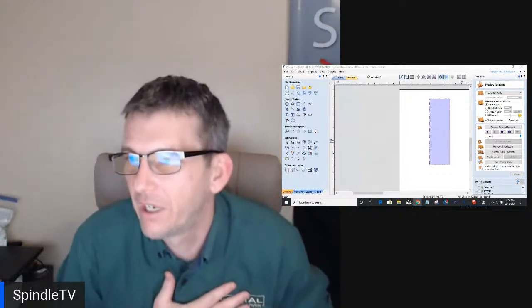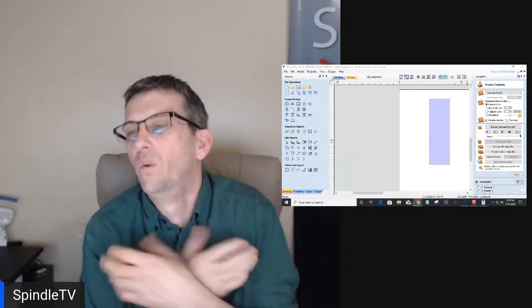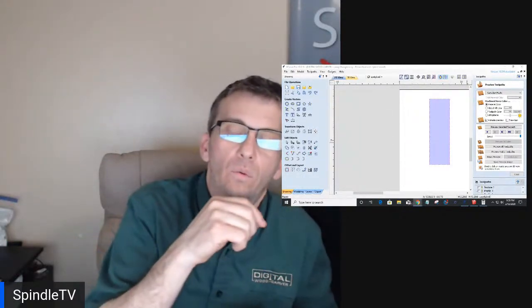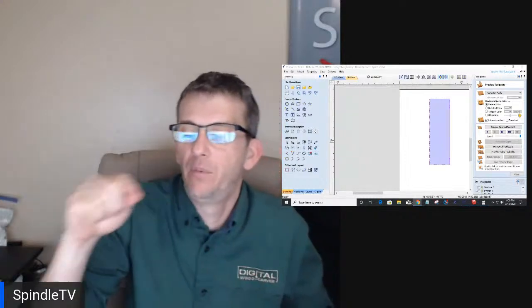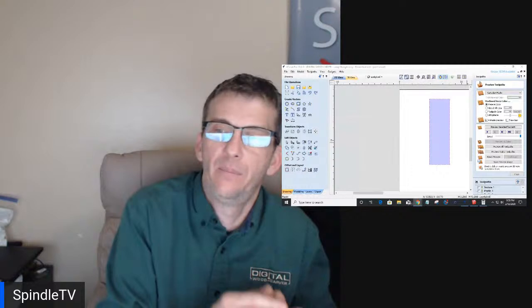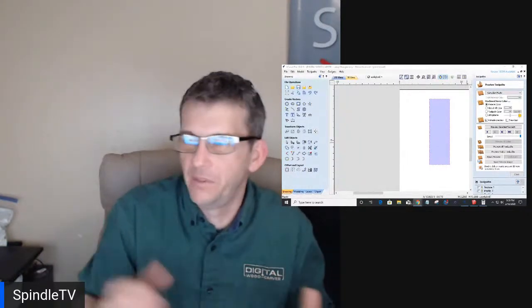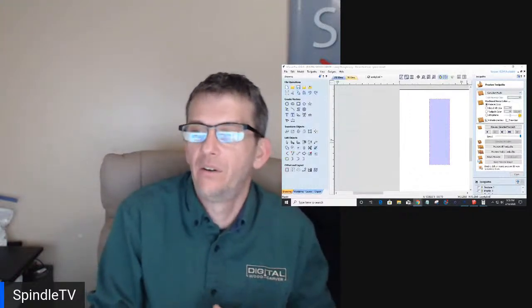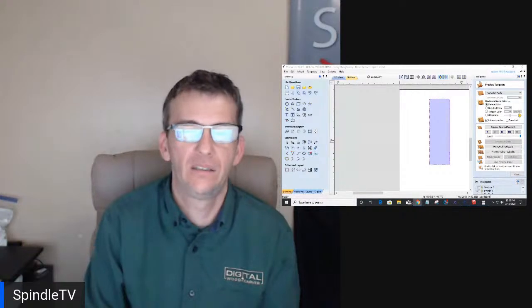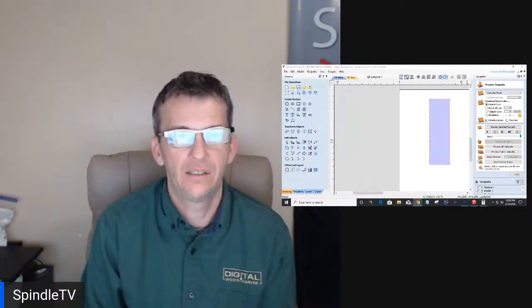But your material, you're cutting it out of plywood and your plywood is only 0.11, right? You can take your 0.11 material, divide that by the 0.125 and you'll get a percentage. And you can go into that size box and size that up by that percentage and it'll scale it up or down to fit your material. That way your slots are the right size. So a nice little way to utilize the math.